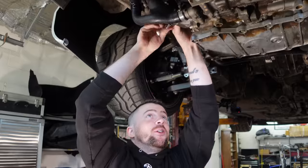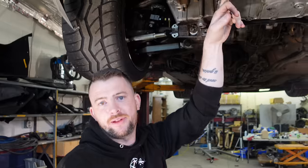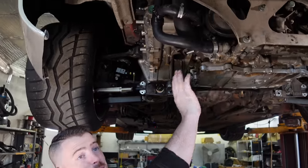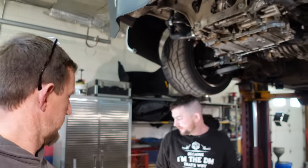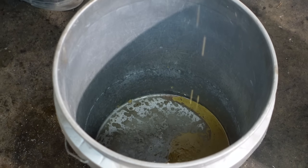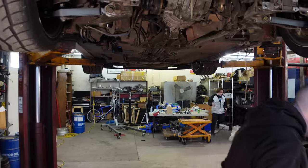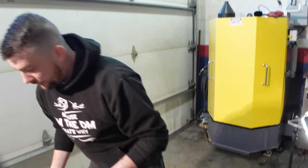I'm pulling the thermostat off because we have a different thermostat housing to throw in. The thermostat inside would block any flow, obviously, so we're throwing in a thermostat housing that has no thermostat and has fittings so we can pump bilge cleaner through it — which will get rid of all the oil and other junk from that intermixing problem. I'm going to pull the thermostat off — here's the non-thermostat one we're going to slap in real quick — and then hook up the bilge pump.